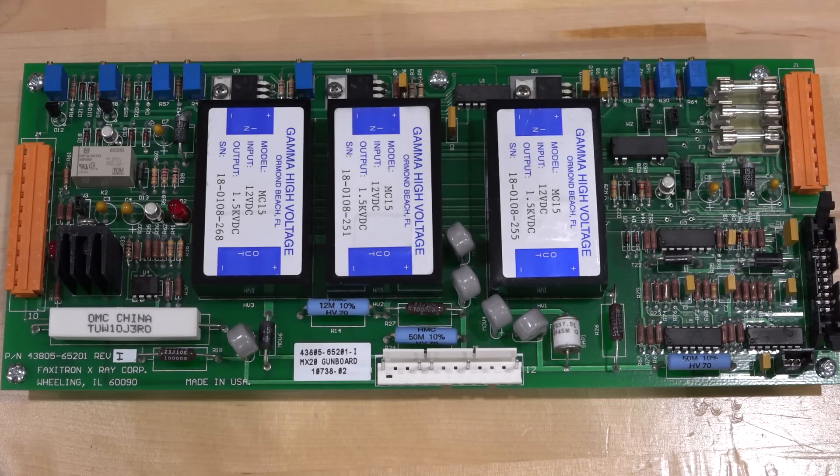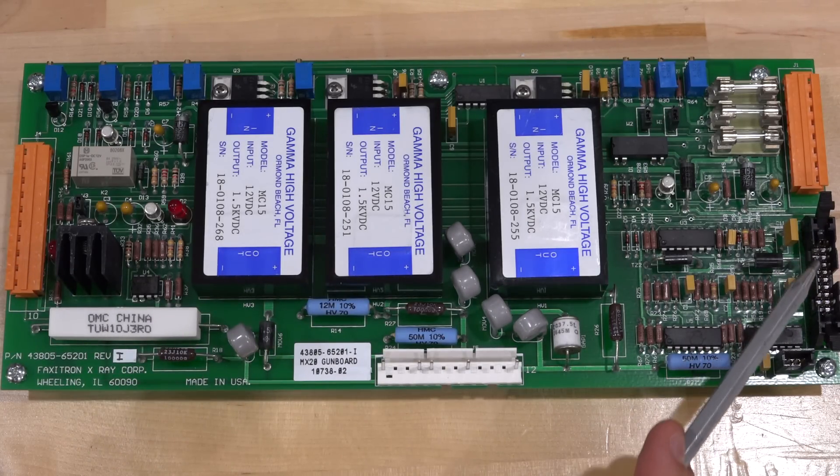We can put this back together. Everything is controlled over here — these lines feel soft and silicone-like, so they're most likely high voltage too. There are a couple of modules I suspect are high-voltage modules, meaning this thing is voltage-focused. That's a good sign — the focusing is indeed handled here. Here's the main Faxitron X-ray tube controller board, which handles turning on the tube, controlling the heater, controlling the current, and doing the focusing.